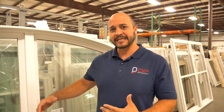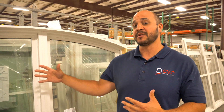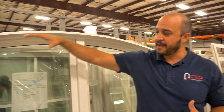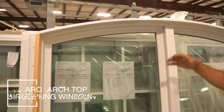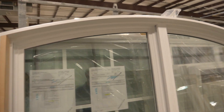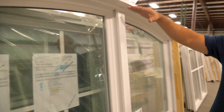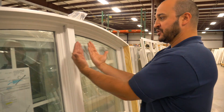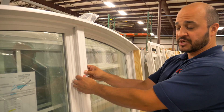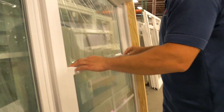We have one of our builders who has a house with a specific architectural look they want, and there's several of these windows in the house. What this is, is actually an arch top — what's called an arch top single hung window. We build a single hung window, which means you have one hanging sash that operates. The top is fixed and we're able to create this arch along the top, then take these two windows and what's called twinning them — twin these two windows together to make one unit with one continuous arch and these bottom sashes that actually operate.